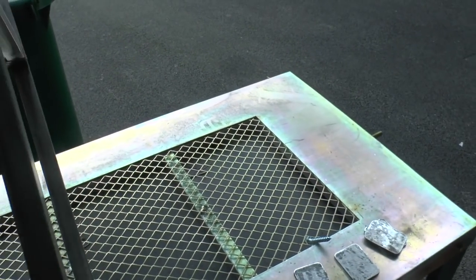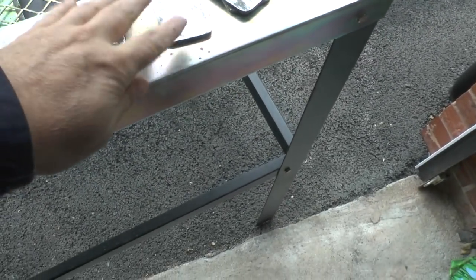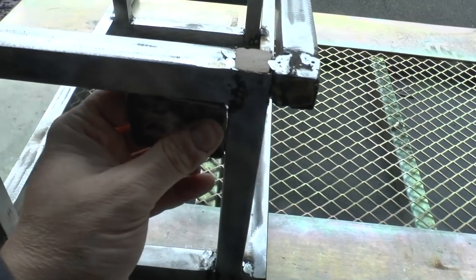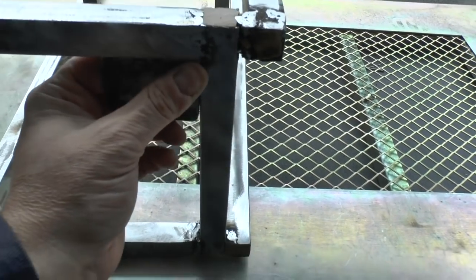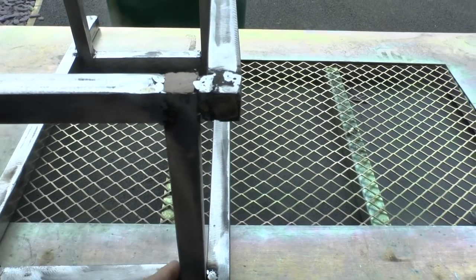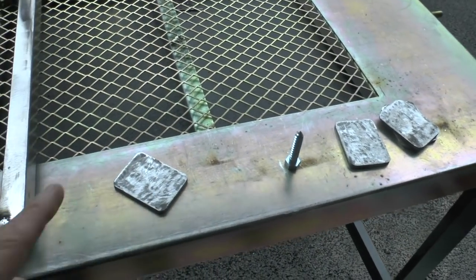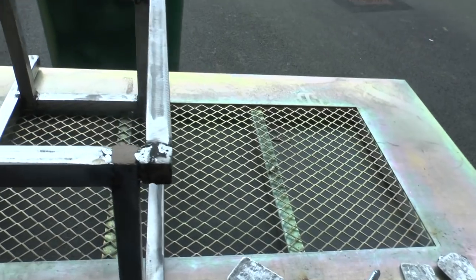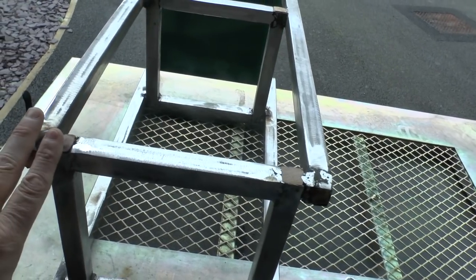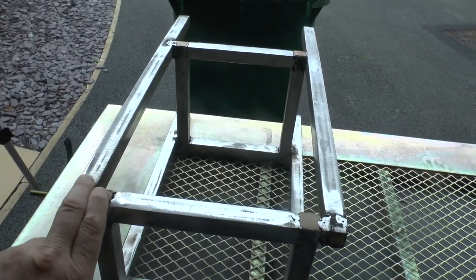But basically what I'm doing next is I've got these metal plates, and I'm going to attach the metal plates in place there, one on each internal corner, and then I'm going to use these coach screws to go through the holes. I'm going to drill in these to attach the stool top that I power carved. So what I'm going to do now is just get set up for drilling the holes. That's what I'm going to do. I didn't know where my head was then, sorry.